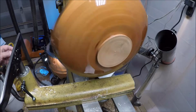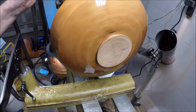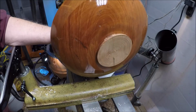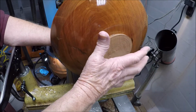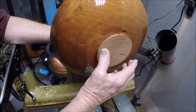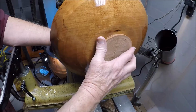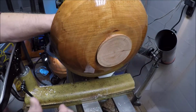Now this is being held in place only by the vacuum. And the vacuum, if you pull the air out from inside here, which we've done, then you want more air rushing in there. That's what happens. And the air rushing in there will give you about 14 pounds per square inch of the chuck against this bowl. So you've got quite a bit of pressure there.